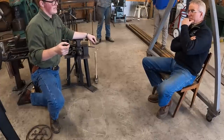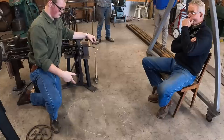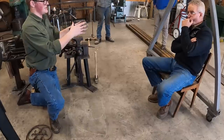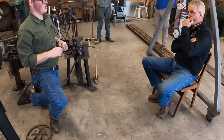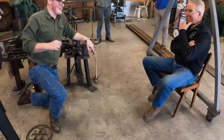That's right. And so you do that with the Fibonacci scroll. Then you add the thickness of the jig, making one hot scroll. You take that fixture, make another jig. You do it one more time, and that last one will make a C scroll that touches, and that's called a logarithmic spiral. You're killing me. This is awesome.